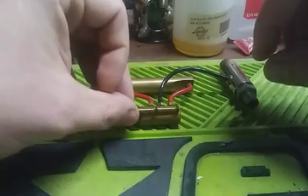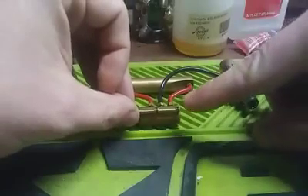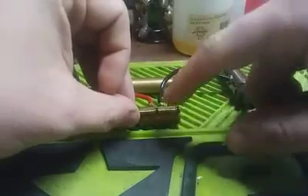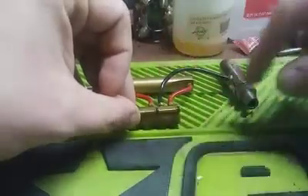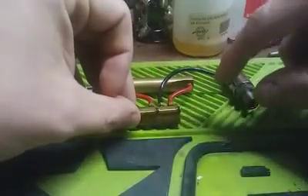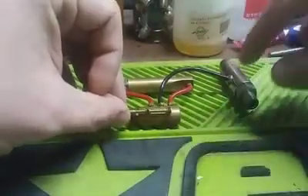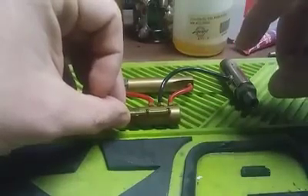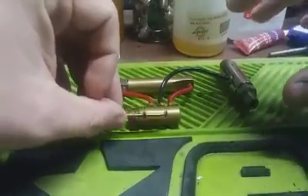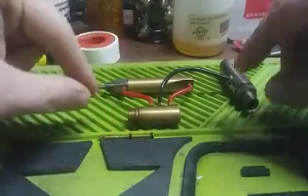Since it's a hinge frame it's going to push this forward — that's what's actually going on in your three-way, you're just moving the area at which that air is distributed. So now we've fully pulled the trigger, this moves all the way up, and now we're taking the low pressure air and putting it towards the front of the ram, which is going to cycle the whole bolt assembly backward and recock the marker. Then when you let go of the trigger it moves back, brings the ram forward, closes the whole assembly, and you're ready to fire again.